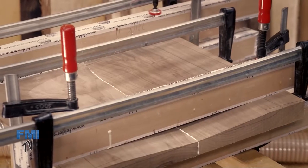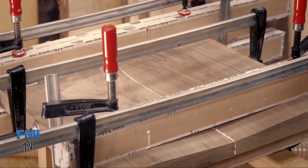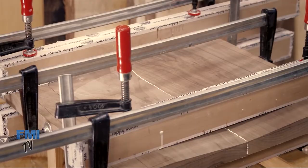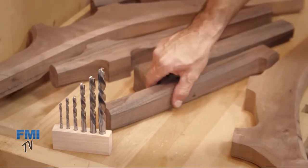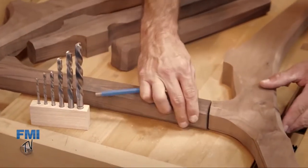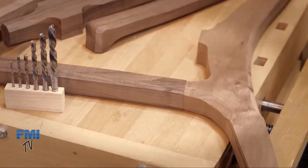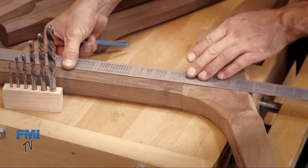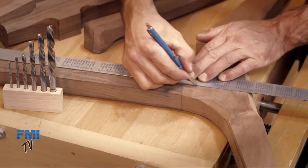The two seat components can now be glued together. As the glue dries, the connection between the armrests and the chair legs can be started. It involves what are known as covered holes, which after the screws are inserted, are covered up using a wooden dowel. This method has the advantage that any tolerances or variances can be more easily covered up for.